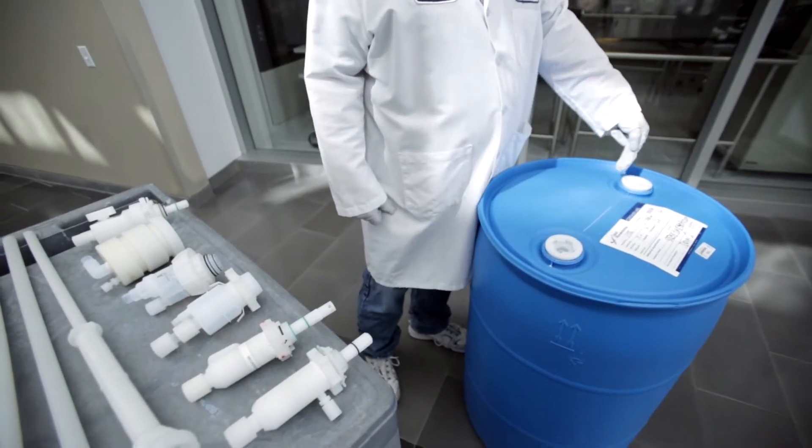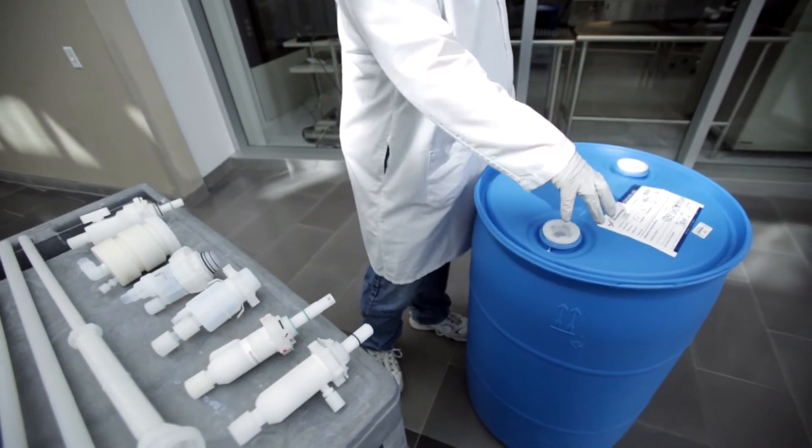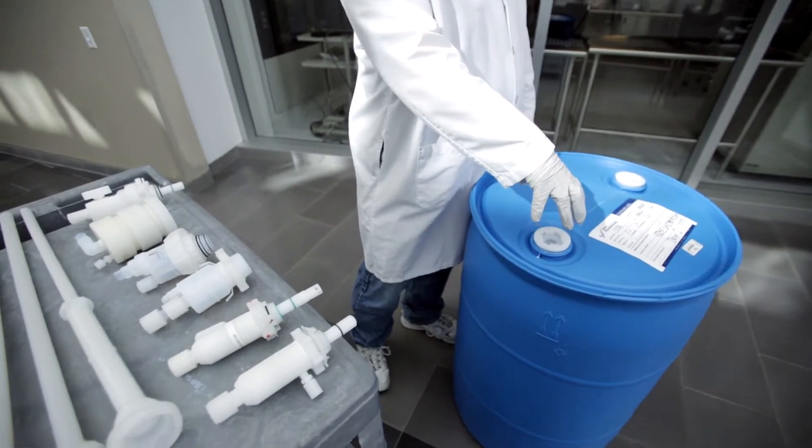In some cases, you can have a situation where mechanical agitation is on one side of the drum and a separate feed and return dispense head is on the other side. That type of configuration is not uncommon; however, you can't use that with a foaming slurry.